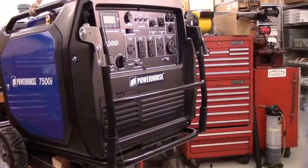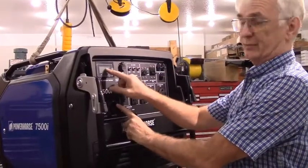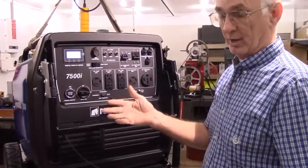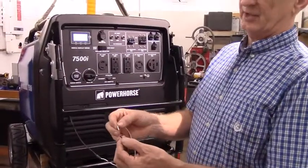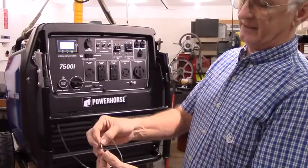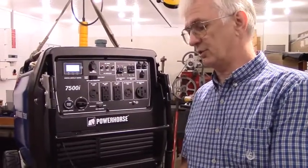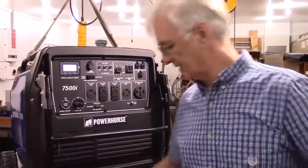Now, if the generator was stock with the exception of this, you'd turn the fuel selector knob on and it would turn on the electronic panel. With my fuel kit in there, you turn on the electronics by this little micro switch. Normally you would hit the button to turn it on and then hit the button again to turn it off. But now if you connect these two wires momentarily, it starts up; connect them again and it shuts off. So you can extend these two wires 50, 100, or 200 feet from your generator shed to your home, or connect these to your automatic generator start controller — it simply gives you a method of starting and stopping the generator by remote control.